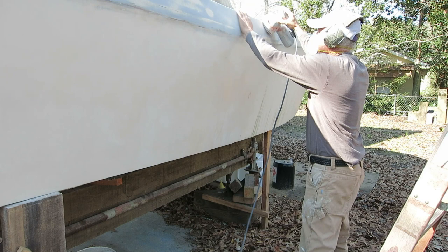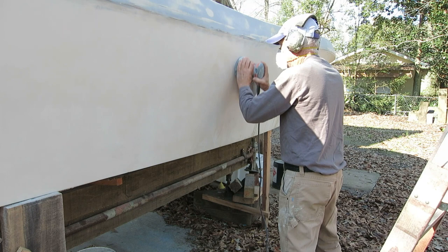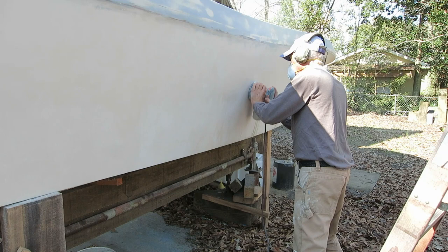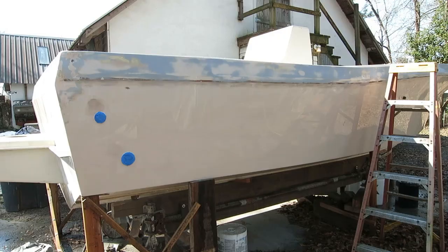Then it's time for calisthenics. It took me about an hour and a half to do the entire hull with 220 grit. What I'm doing mostly is just cleaning off dirt because it's dirty from sitting out there. At different times over the past several months I have sanded most of this hull, so I'm just cleaning it up, smoothing it up, and getting it ready for paint.